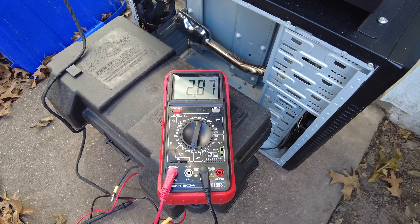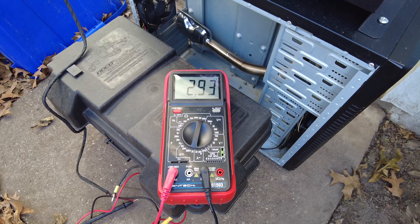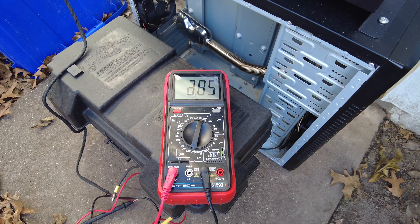I'm going to go ahead and pop it back up to full speed. I'm going to let it get up to full speed, get nice and hot, and then I'm going to do the shutdown cycle. We're going to see how it does as far as the current draw during shutdown, because when it shuts down it will once again turn on that glow plug to clean it off.